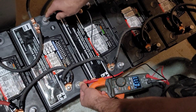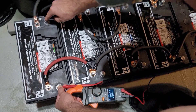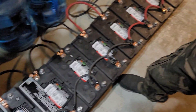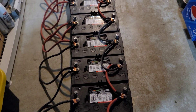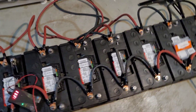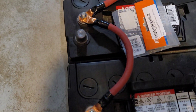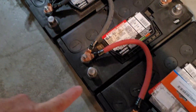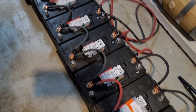These are the new batteries. As you see, it'll teeter between 12.93 and 12.92, and that's because depending on how you touch those contacts it'll show 12.92 or 12.93 — but it's really close to the point where it's nothing to worry about. So that's pretty much it for the battery balancing. Again, positive to positive to positive all the way up the line, then negative. You want to make sure each battery is linking to each battery all the way down. After about 15 hours of balancing, every single battery is perfect.